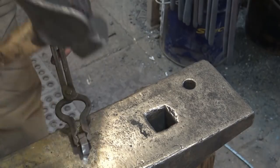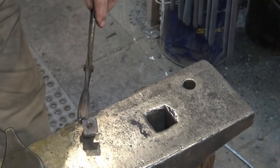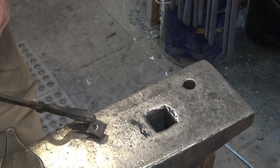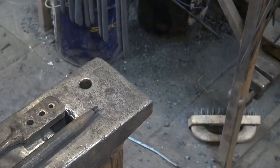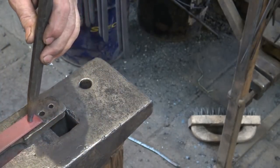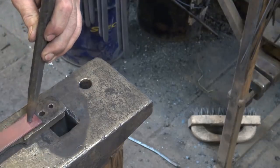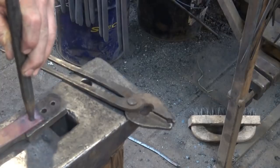It will be a little bit of a lopsided nut. So there's the nut that goes with the bolt. We're going to let that cool. And the bolt is probably almost cool. Now how about we make a washer — I'm just going to take a piece of eighth by one material here. We'll make a square washer to go with our square headed nut and bolt.